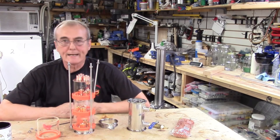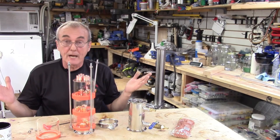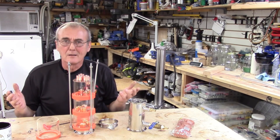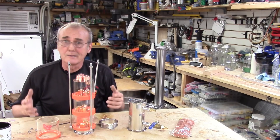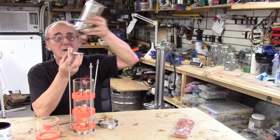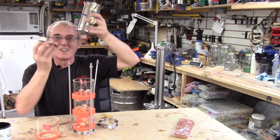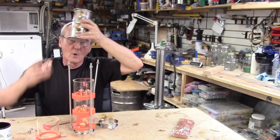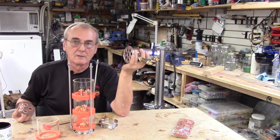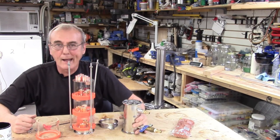So make sure you orient those correctly — this thing runs amazing. If someone's going to ask, well George, what would happen if you put it in upside down? Well, there's no right way to do the wrong thing. If it's upside down it does not work properly. What happens is you've got this sitting up here and your dephlegmator starts to fill up with water or with your mash. And what happens when the dephlegmator fills up with mash? It starts to puke. So yes, it makes a difference — there's a right way to put it on here, and by golly, there's a wrong way.